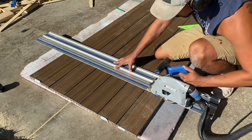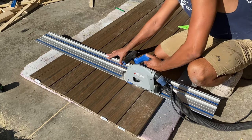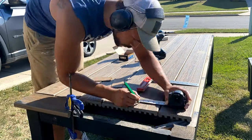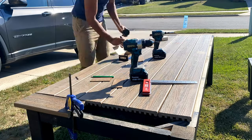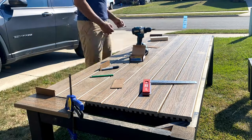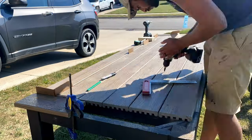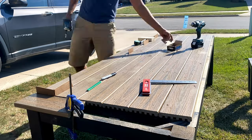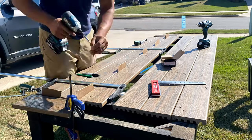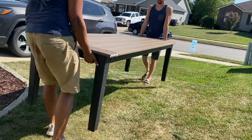While the table base was drying, we turned our attention to the tabletop. We're using the composite decking material for its durability and low maintenance. You do have to send screws through the top to attach the boards, so I laid out clean symmetrical lines. But when I started driving screws, I realized that without pre-drilling or countersinking, the screw pinches the material and leaves a ridge — really ugly. A quick countersink completely fixed that, and using eighth-inch spacers clamped down as I screwed everything together came out really well.